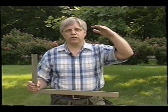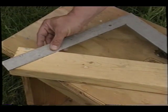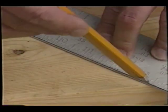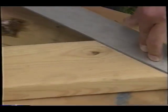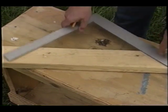All you've got to know is the pitch of the roof you decide to go with — that might be 4 inches of rise and 12 inches, or it could be 12 inches of rise. The bigger those numbers are, the steeper the roof's going to be. All you need to do is hold the square on the piece of wood, and magically it transforms the angle of the cuts for where the peak of the roof is and where the rafter sits on the wall. It's really that simple.